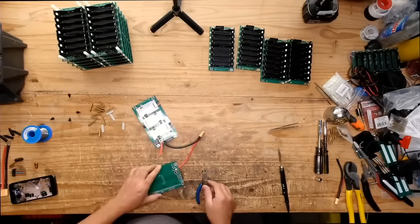And that's the reason why I'm keeping these boards that way. So they're versatile, so they can do 24 volts and 48 at the same time, because then you can use them for anything. No 12 volts, unfortunately. But you could use a 24 volt to 12 volt DC to DC. They do exist. They're quite common, because sometimes RVs have 24 volt systems and then you have to step down to 12.